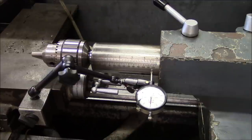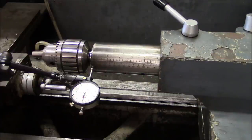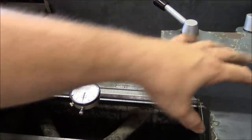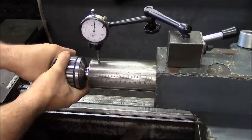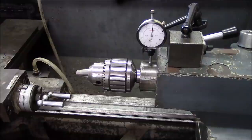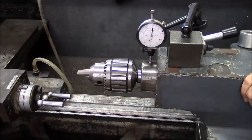Same test in the horizontal plane — it's about half a thousandth out, which is actually what we would want, so that's pretty good. Make sure you have your tailstock barrel clamped and the body clamped when you do this test. Testing the quill in the tailstock body to make sure it's not worn or loose: about one thousandth of lift at five inches extended — that seems pretty good. With the quill retracted it's basically zero.